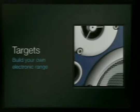Y'all all saw this one. And that's what was in your hand a second ago. You saw that. This is the inside of it, and I am the master of putting this stuff together. But it has... Where's my lighter? Oh. Thanks. Okay, that's a really bare bones Arduino that is talking to an RFID antenna that's talking serial. And then it's talking serial to the LCD over here. So that big jumbled mess of stuff is really actually kind of simple. And it's not even using the full power of the little $10 device inside of it.